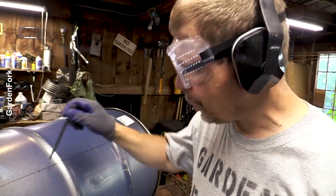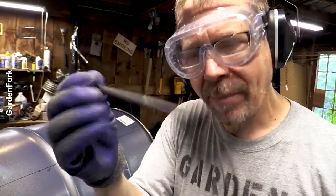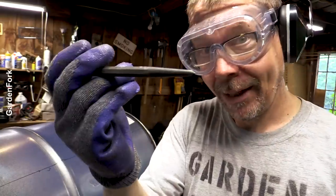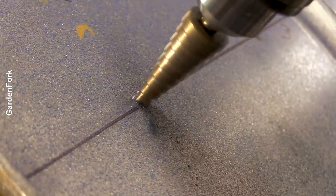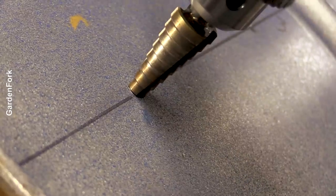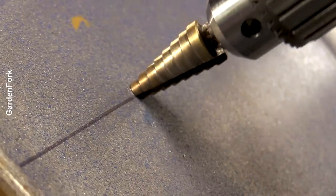I'm gonna use a corded drill for this. We're gonna use a center point punch to set up — basically you put a little dimple into the metal, and when you drill, that way the drill doesn't go all over the place, it just goes through. So now I want to go at an angle, because the rebar isn't going straight across — the rebar's going kind of at an angle. It'll make sense later.